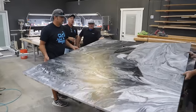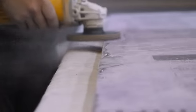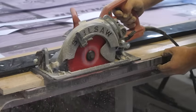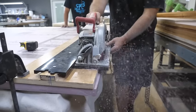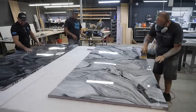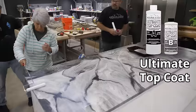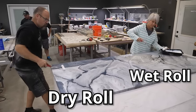Check out that Carrera marble project. Back to our giant stone wall — well, it's foam that looks like stone. We're going to remove those drips and load this in the trailer. I'm double checking my template measurements because I oversized this — I gave myself plenty of material to work with. I'm trimming the edges so I have a nice factory cut and my snug fit comes out just as planned. After I've removed the drips, I'm going to sand with 220 grit so I can apply our ultimate top coat. This top coat gives a very natural sheen, it's easy to apply, and it's extremely durable.